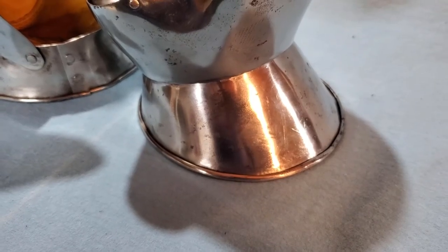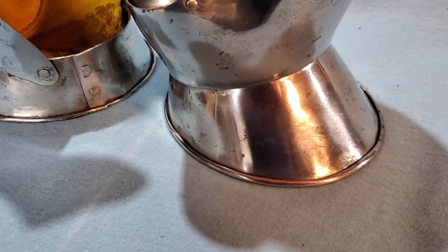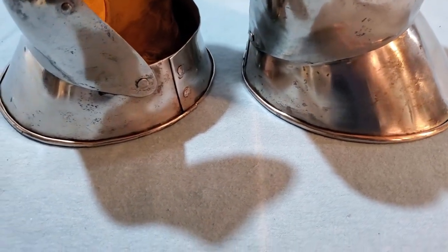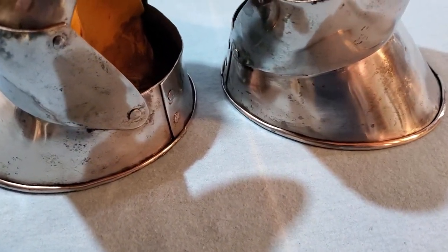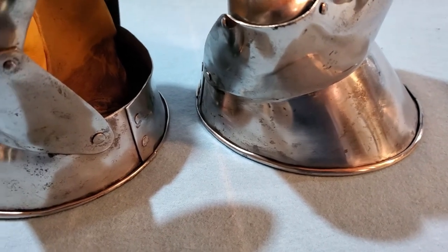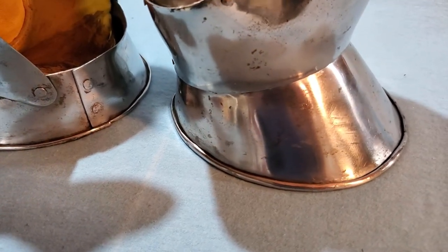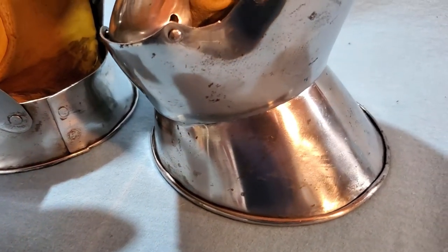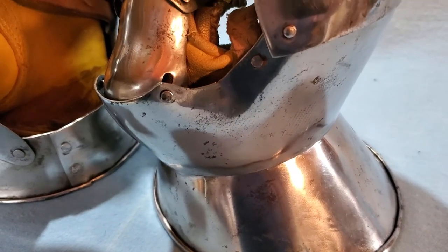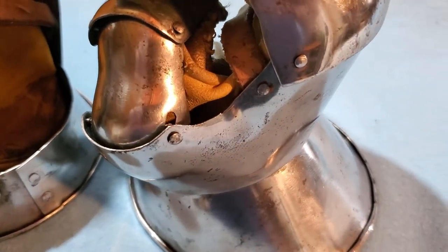Here are the details of the third generation. Again, still not happy with the cuff. We've changed the angle of the cone so that we're working on more wrist motion. We've reduced the section of the cuff that is closest to the palm to make that smaller, again, to increase maneuverability. As we move up into the back of hand, again, the area between the thumb and fingers is a little more shaped to match the hand.